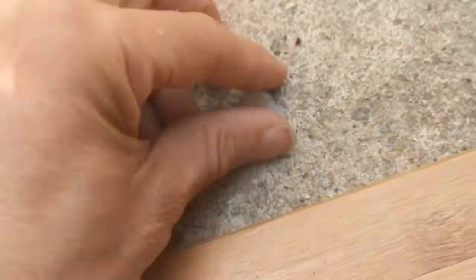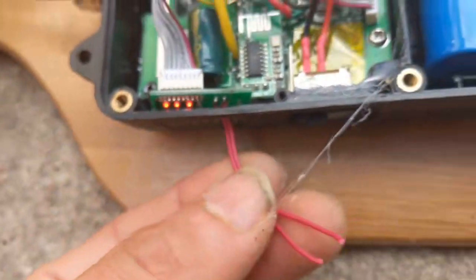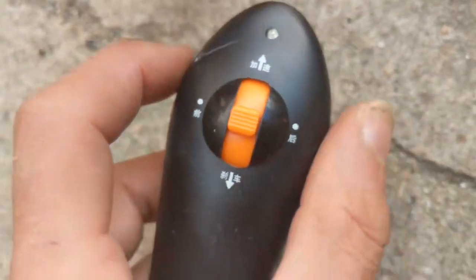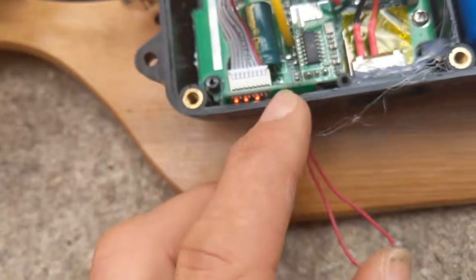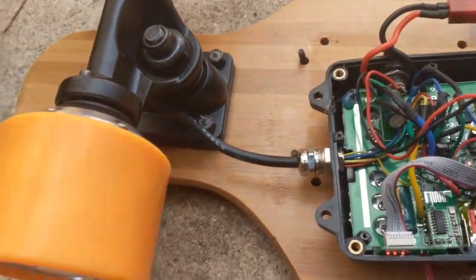I had to remove the plastic here — they're always glued with a glue gun — so I simply glued in a new switch. And that's it. When I turn it on, the LED comes to life. The battery status indicator works. The pairing button was also non-functional, so I ran some cables and learned that you push both side buttons for five seconds, which causes blinking to indicate pairing mode, then power it on. Now you can see it's working.